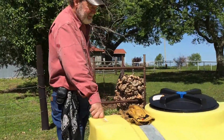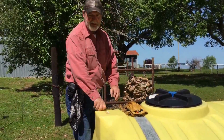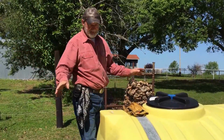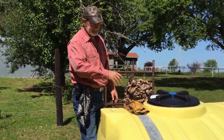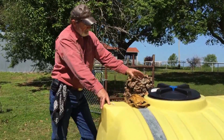Now I'm gonna leave this hard nozzle on here, and we'll put this in the tank. And we'll pull this lid on top of this hose. I'll make it center there. Okay, all right. So I've got the lid on the hose, the hard nozzle running. I'm not running any agitator. My tractor's off. And I'm going to walk away from this tank for about an hour, let that hard nozzle just work in there, and then I'll come back later, pull that hard nozzle.